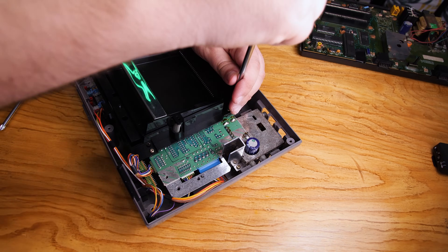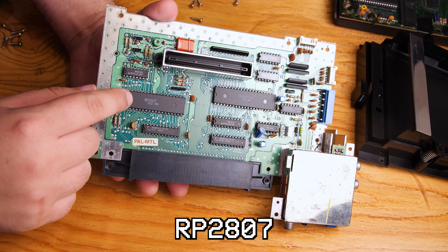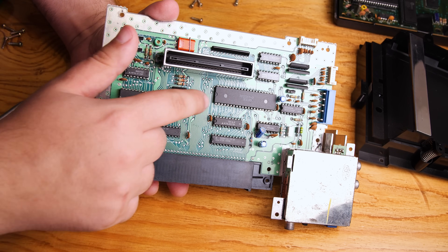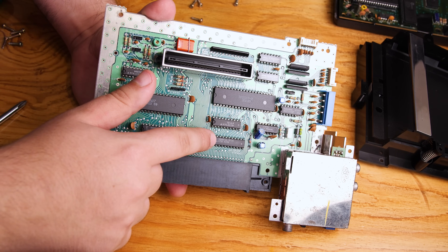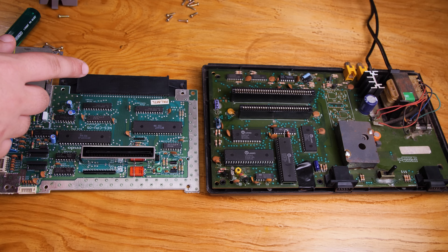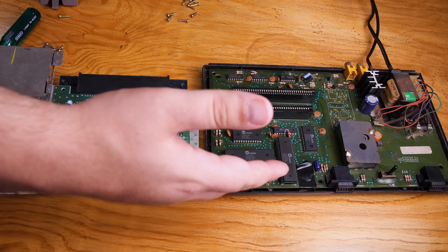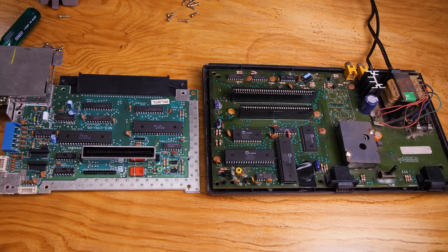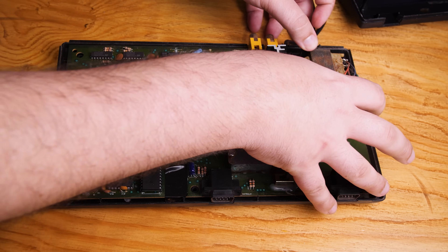To put this thing in perspective, let's have a look inside an actual NES — my PAL NES from the first part of the Eric experiment. Here's the CPU, the RP2A07, the 2C07 PPU, and here are the SRAM chips. Looking at them side by side, the real NES has a smaller board but more ICs: 12 in total, as opposed to the 9 ICs in the VG-9000T. Now that we've looked inside the CCE console and nothing seems physically wrong with it, we can safely test it.